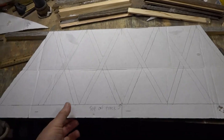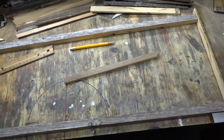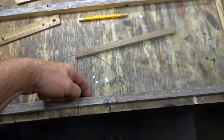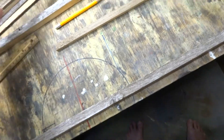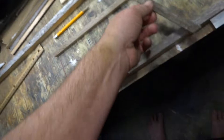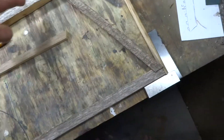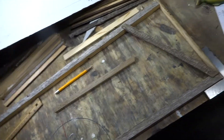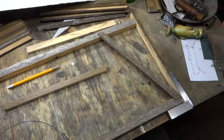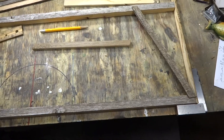Like I told you, first I drew this out. Now these two bars are the 28 and 5/8 inches long. I want the bridge nine inches high, so this is nine inches from here to here. I'm going to glue stabilizers from here to here at exactly nine inches. You can see I already cut all of these — they're not right, but I'm going to make them right. I'll lay that right here, go on the backside, draw a line on each one and snip them down. Give yourself a little hair long because if it's just a little long, you can always sand it down. Once it's short, it's scrap wood.